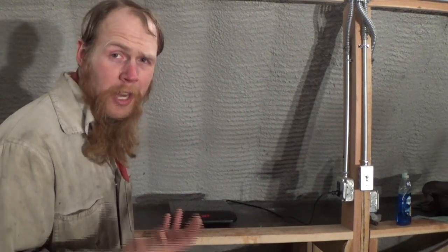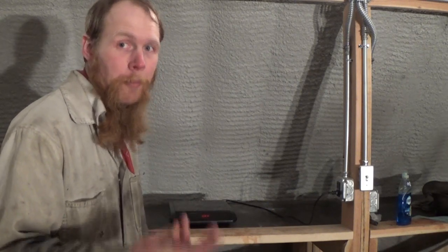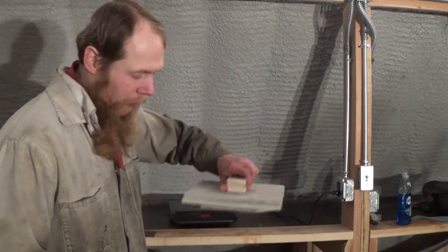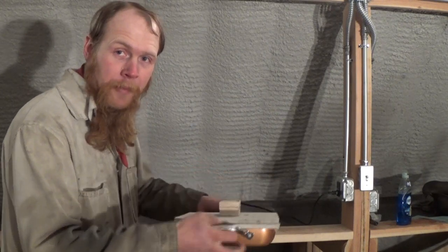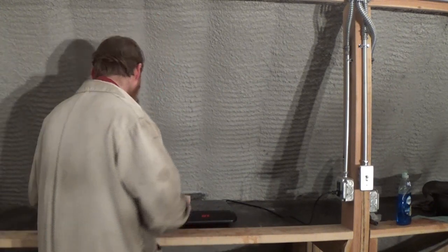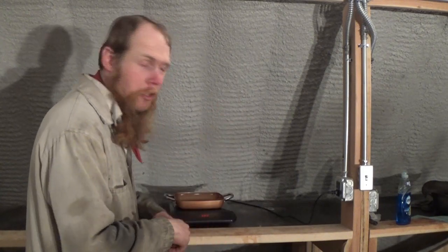But the real question is, will I be able to use this hot plate for tempering steel? And so, since we've established that the digital temperature control does not work as such, it won't actually regulate the pan temperature to the temperature that you set it to, we need to figure out if these open loop duty cycle ratings, or whatever the alleged temperature control actually corresponds to, can be used to get consistent temperature control under a certain set of circumstances. So I'm going to use the original pan, and I made an insulating cover that I can put over it to turn it into basically a little oven. And I'm going to put that on the hot plate at different temperatures, wait for the temperature to stabilize, and see if we can get any kind of consistency for potential heat treatment of metal. For testing purposes, I'll just put this little scrap of steel in the pan and we can measure its temperature over time.